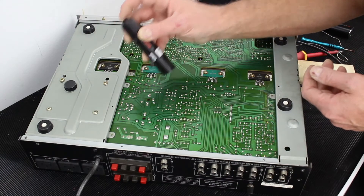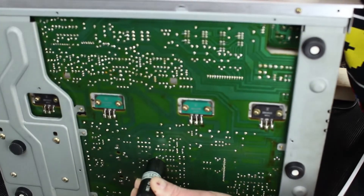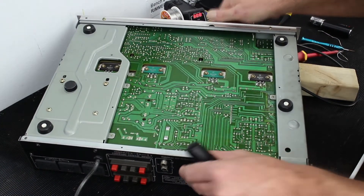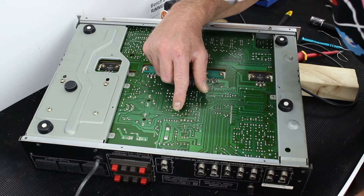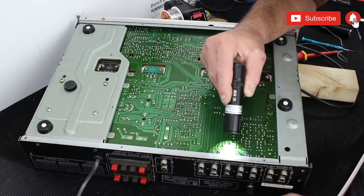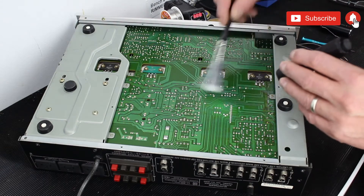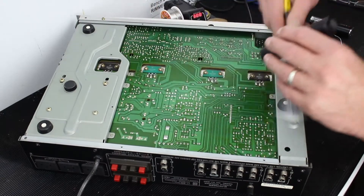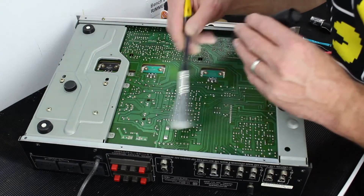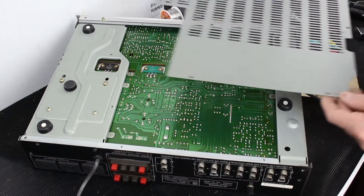There's a little pin coming through the board here but it's not soldered at all. It can be very tricky to work out what components are present, so what I like to do is use a little torch — switch it on, stick it behind the board in the right position, and check on the other side. Using the torch method I can see there's just a spot of solder there and no actual component in that area, so I don't need to do anything with it. This board is in very nice condition — I'll just give it a brush and hoover off, then close it back up and switch the soldering iron off.